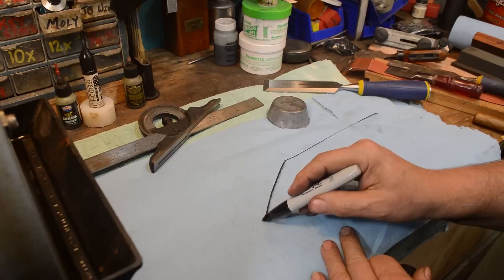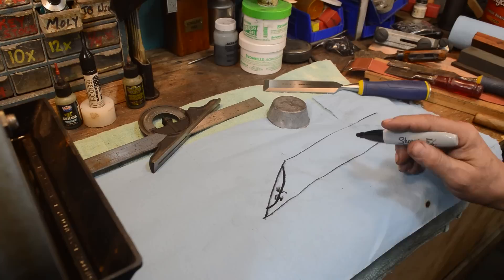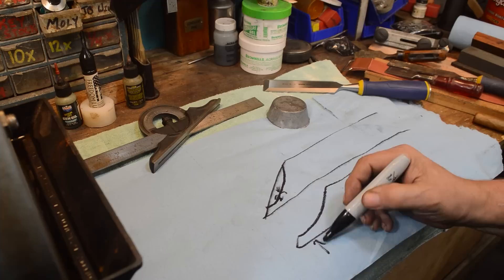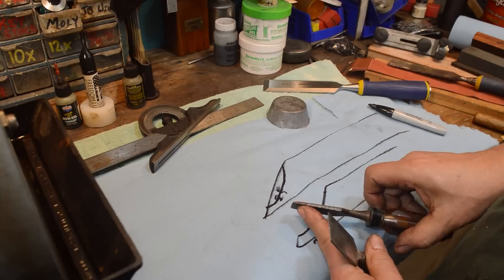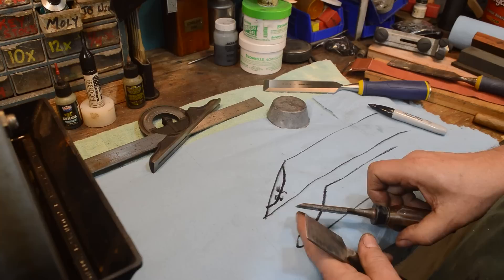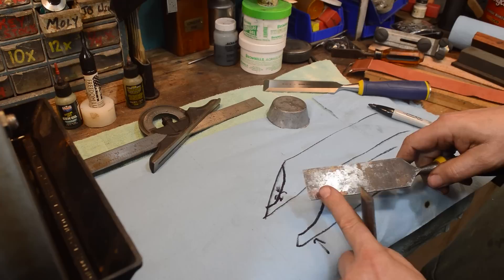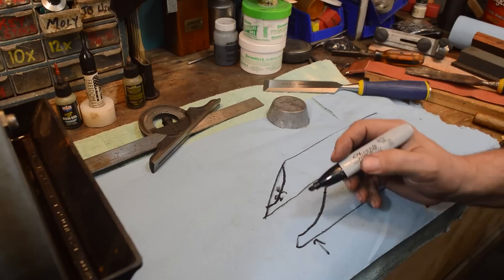We have a 25-degree edge. We're going to use this big stone and scoop this out — I'm exaggerating it — so we're going to have an edge that's hollow ground up to the top and out. It is very important that you keep the backside flat. We have examples here of chisels sharpened where the backsides were not flat — see how that rolls up on the back? Very difficult to control the chisel with that back angle. We need to keep the backside flat and free of scratches, and we may have to polish it because that will show up in your cutting. Not only do we have this hollow ground, but this is going to be the 25-degree angle.